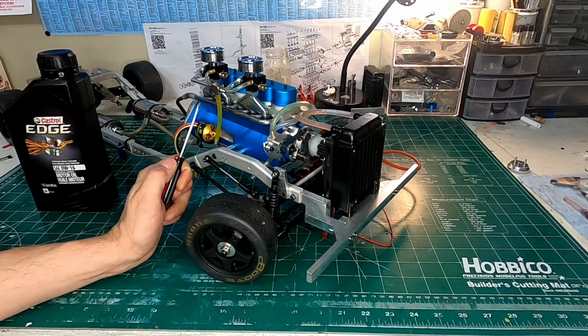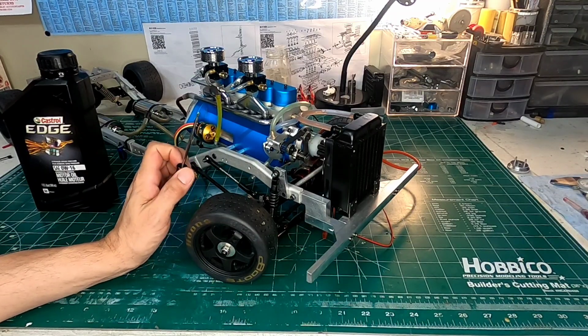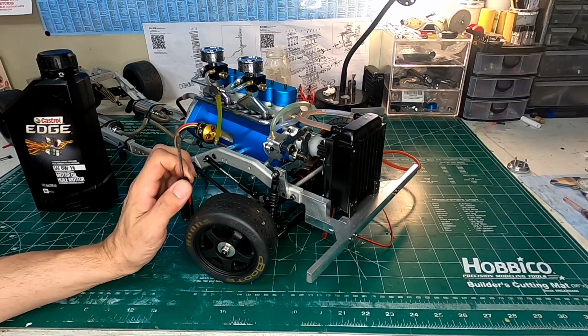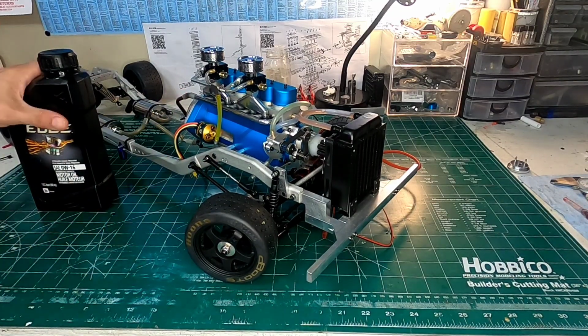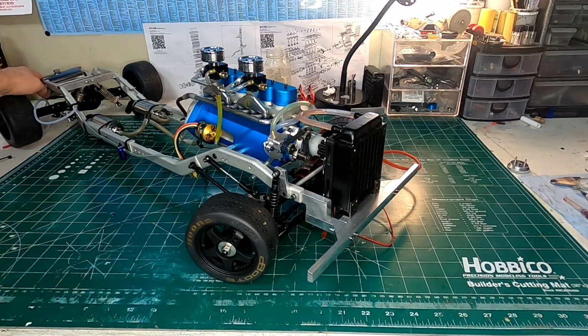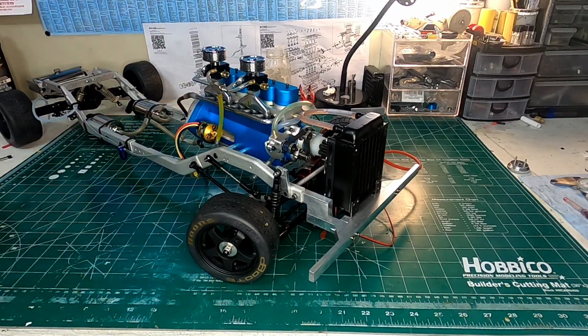The cool thing about the carburetors on these is that the Toyan pump carbs are amazing. They're very easy to clean, very easy to maintain. A shot of air through them, and they have little diaphragms that are super easy to clean. They don't clog up. I've been loving it. It's also able to pull fuel all the way from the back, way back here. There's no problem pulling the fuel from here into the carburetors and running this thing. So phenomenal. Love these carbs.